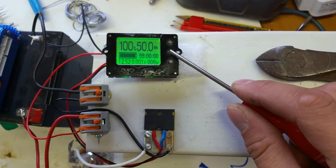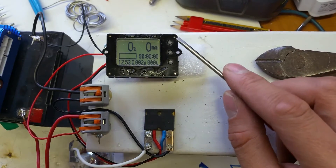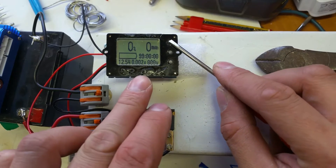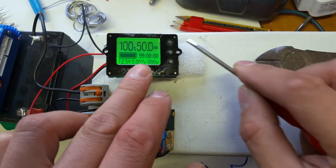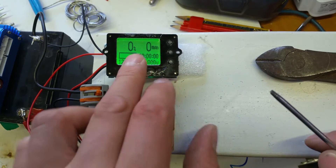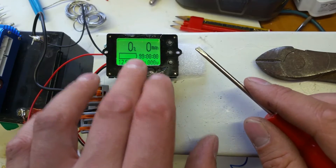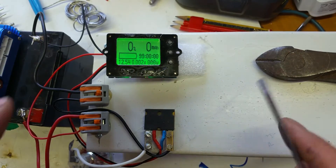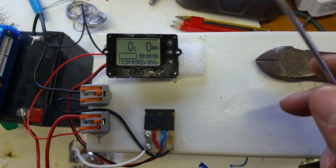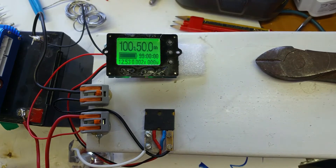If you push the middle button it will completely empty the battery. So you could do this for bottom balancing — you could bottom balance your batteries to a safe level, connect your battery to the capacity meter, and providing the top capacity is set higher — say you connect a 30 amp hour pack to this item with it at zero and the capacity set to 50 amp hours — you could then charge your battery pack up. Although the percentage will be out when your pack has finished charging, the capacity that's gone in may not be 100% correct, but some people choose to do it that way.